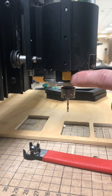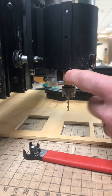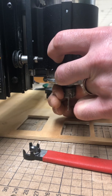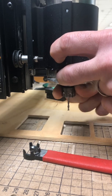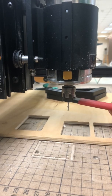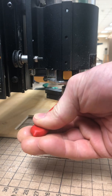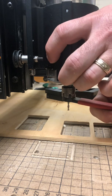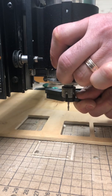There is a little yellow button right here — this locks the spindle. If I push this in and rotate it, it does not want to spin anymore. That allows me to get the tool, slide it up onto here, and then crank to loosen. You have to hold the yellow button and then crank to the left.